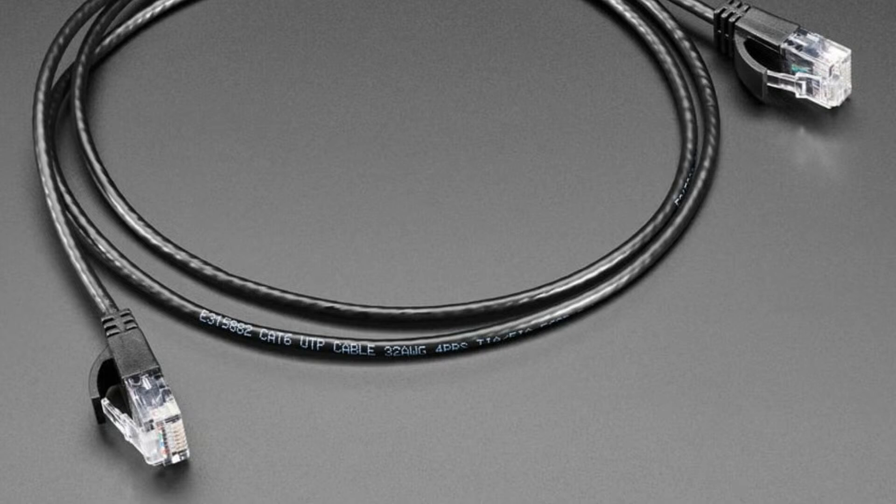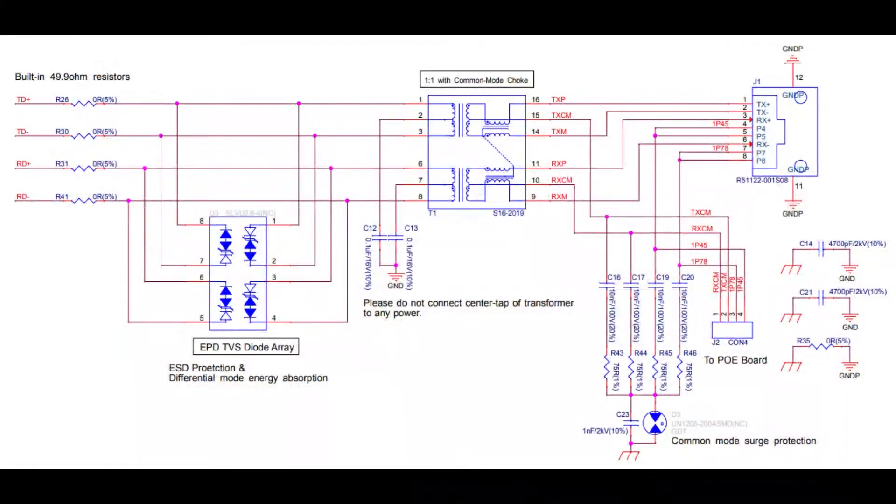To use Ethernet, microcomputers usually use a USB-to-Ethernet adapter — like the Raspberry Pi has a PCH or USB bridge to an Ethernet chip. But a lot of microcontrollers these days are starting to come with what is called an Ethernet MAC, which is not the same as the MAC address. This is the underlying protocol — media access control or something — that does the packet generation, transmission, reception, and collision detection of Ethernet using the four wires: dual transmit and dual receive.